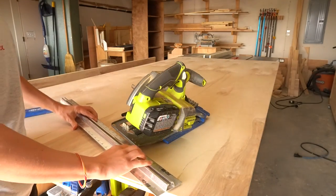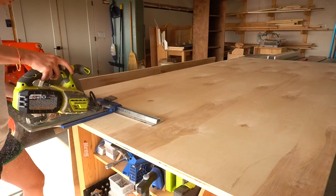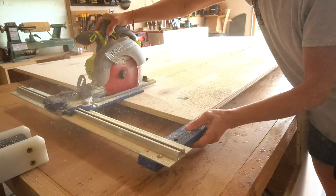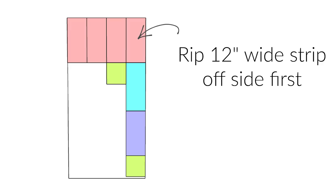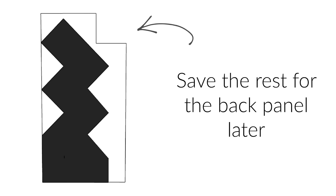With a little creative cutting, you can make this entire shelf from just a single sheet of 3/4 inch plywood. I've got the complete cut diagram linked below, but to fit everything from one sheet, I ripped a strip off the side about 12 inches wide to cut three shelves and the base plate from. Then I cross-cut a 26 and a quarter inch section off the sheet to rip three 12 inch wide strips from, then cut out this little piece here for the last shelf piece.